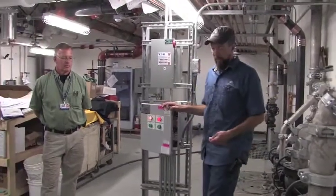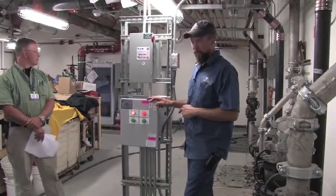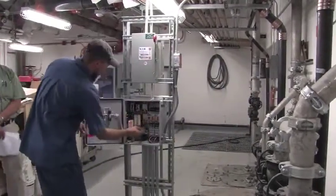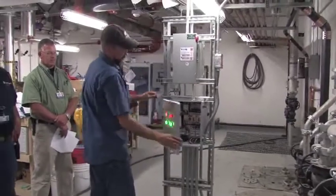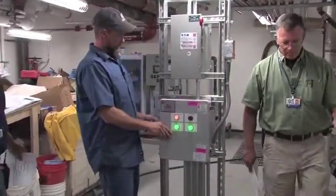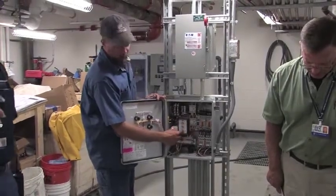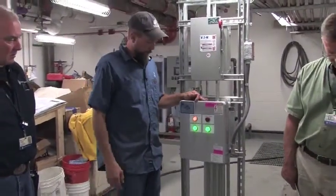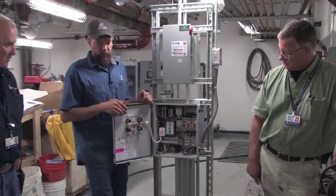Right now the pit's full enough to initiate the lead pump and the alarm. I'll put both switches on. I silenced the alarm. I'll get it down and false the lag circuit — call both pumps on, pump it down, and then trip it out to show you the alarm again. So there's number one; number two hasn't come in yet. Now you've got lead and lag and your high water alarm. It's not going to go out until the level drops. High water alarm's been cleared. That's your horn. You get your two HOA switches, alarm test and silence here, and the silence again on the side of the panel. Once it pumps down and stops, the alternator will swap — number two will be the lead pump next time around.